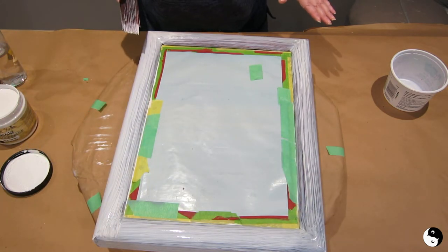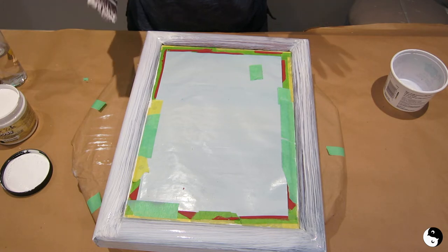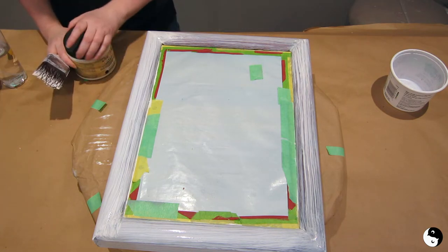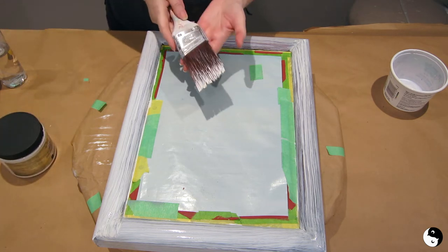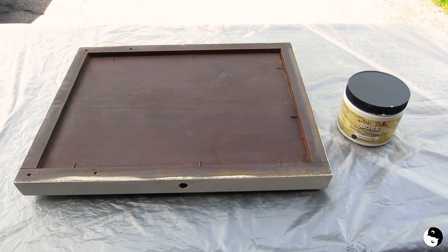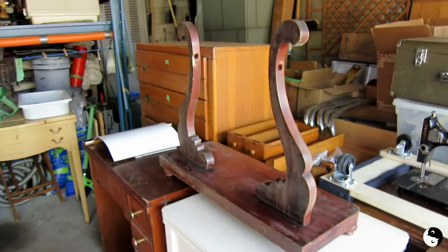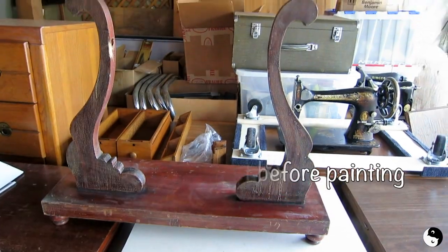I'll take just the point of the angle brush to get that edge, then come back with longer strokes. I'm going to let that dry for an hour, come back for a second coat, and then this will need 24 hours of dry time before we can put the paint color on top. I haven't decided what color yet, so you'll just have to wait! Don't forget to close your lid so the primer doesn't dry out. I hand-brushed two coats of gloss on the front side, and now we're going to spray the back — my husband is going to give it a spray, along with the bottom half. We gave it a light scuff sand first.